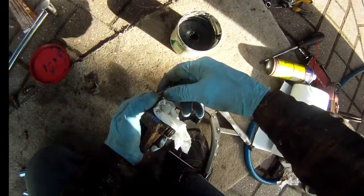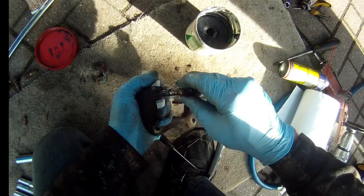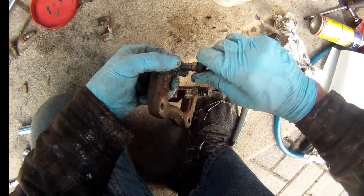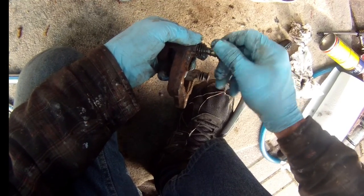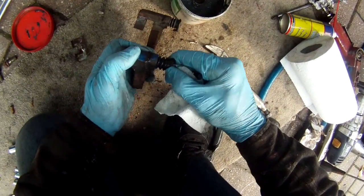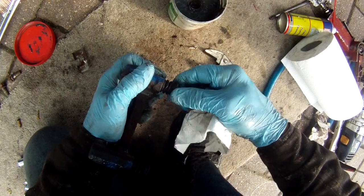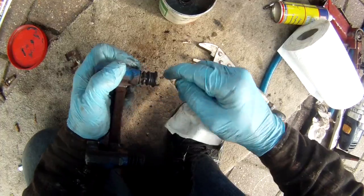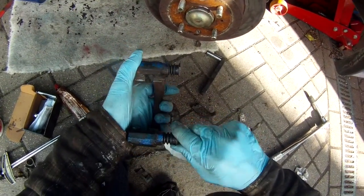I'd like to use this moly grease. When these are originally made they come with some sort of graphite grease inside — moly grease is pretty similar; it probably doesn't matter what sort of grease you use. Push a bit of grease in there a couple of times, maybe rotate to give it a chance to release the pressure. We finally managed to get the pin in and the seal will stay in — that's that one done. The other pin is also pretty stiff but a little bit more lubrication and both pins are now moving nice and freely.